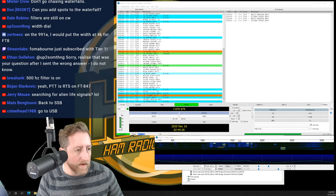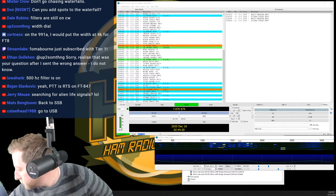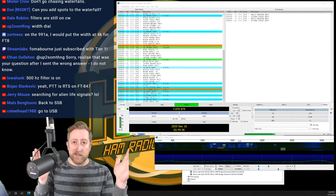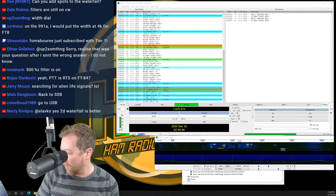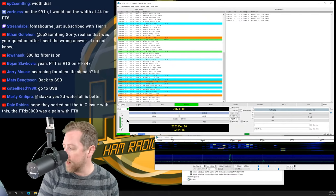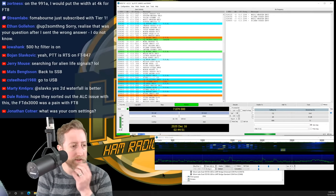Searching for alien life. Yeah, PTT is RTS. 500 hertz filter is on. Aha! Thank you. That was why. Roofing filter was on. So yes, you can both change the bandwidth, which is what I did, and the roofing filter. But now it knocked itself off frequency. Did I click it? That's why. There we go. Good catch on the roofing filter.